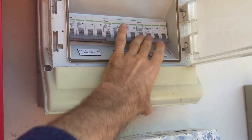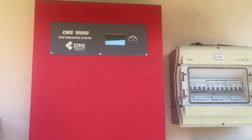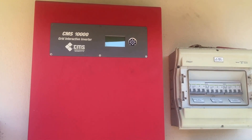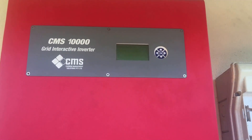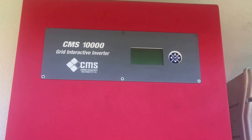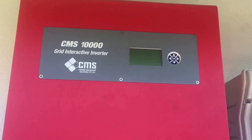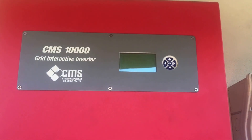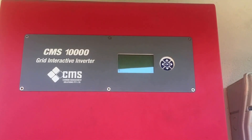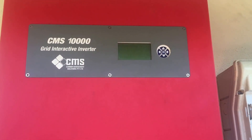I'm just going to turn the system off via the solar supply main switch and wait for that noise to go away. So if your inverter is doing something like this — where even after going through the reboot and startup procedure it's still coming up with the same error code — then you've got an internal problem with the inverter. Unfortunately, CMS are no longer around to honour any warranties, so it is going to be a case of replacing this inverter. We highly recommend the Fronius Symo 10, which is a three-phase 10 kilowatt inverter and a great quality replacement for the CMS-10,000.